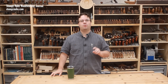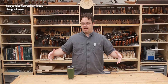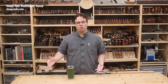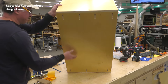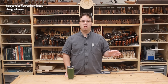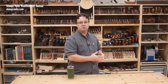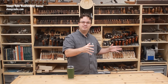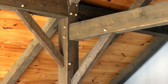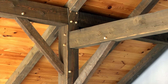The key is to use it properly. Just as I wouldn't use regular miter joints to fasten legs to a table, I wouldn't use pocket screws where a mortise and tenon would be more appropriate. But I guarantee that a kitchen cabinet assembled with pocket screws will last just as long as one assembled with rabbets or dados, because kitchen cabinets are attached to kitchen walls. They aren't subject to the same forces that a table or chair would be. Just as not every house is built with mortises and tenons, not every piece of casework must be made with dados.